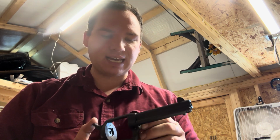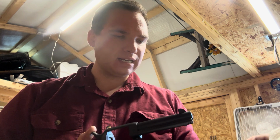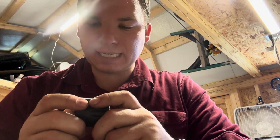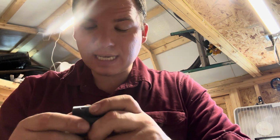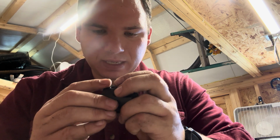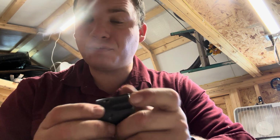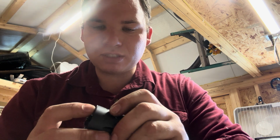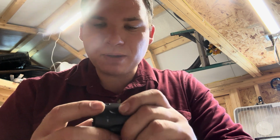So this is the Cattleman, the Hombre, with the racing notches cut into the bolt and everything. And the good thing about cleaning this gun every time I shoot it is I get to look at this cylinder and see if there's any damage being done by fanning the gun. If you fan a stock gun, you will break it. Eventually you'll shatter the bolt, you'll rip out the grooves and notches, you'll rip out metal.